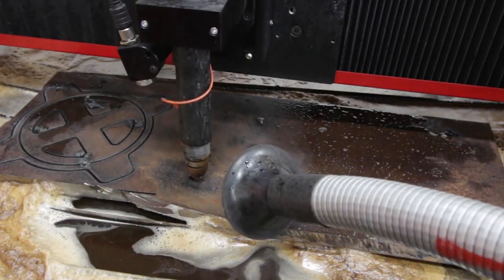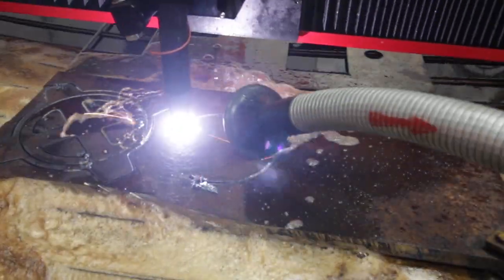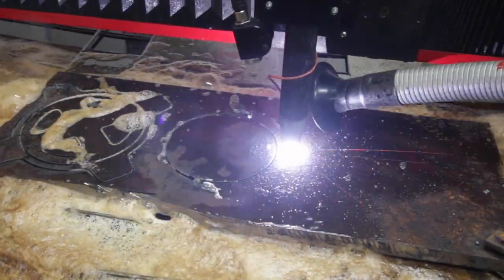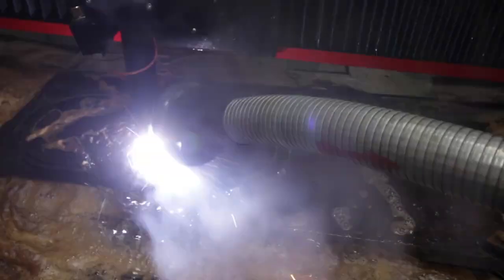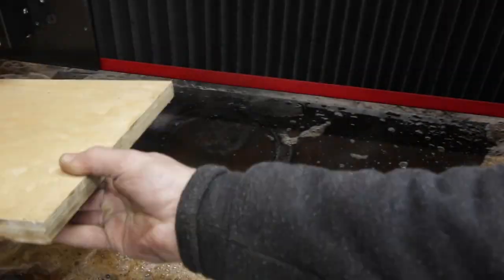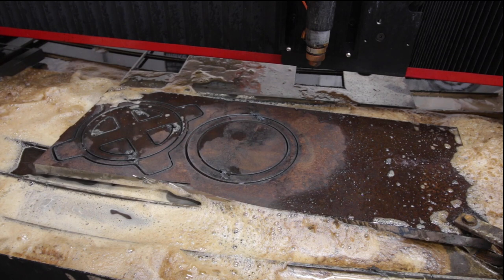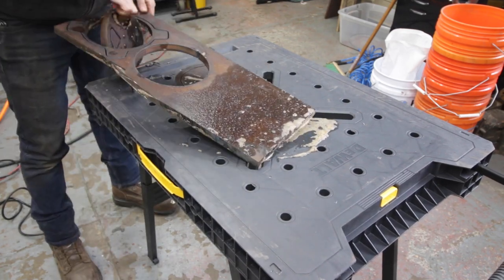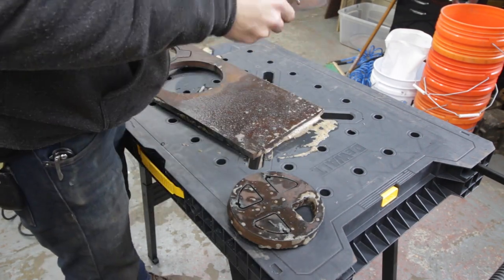The shapes I'm cutting here are the base, a spreader lock, and a second collar that I'm going to weld onto the base so I can build up the overall height of the swivel base and give the spreader something to lock up against to keep the vise from moving. I had a little break point where I didn't clean the metal well enough so the torch wasn't able to make contact, so I had to get in with the Sawzall to cut up one of the little pieces, but overall the cut quality was pretty good.